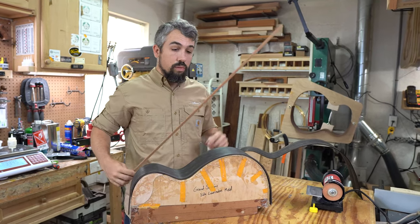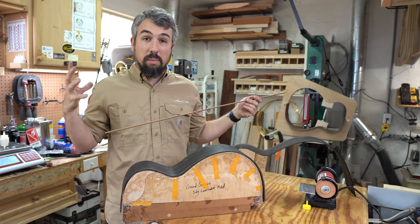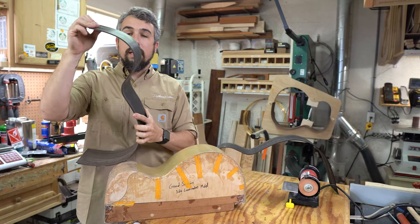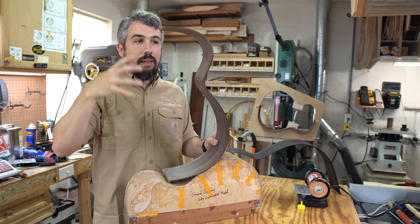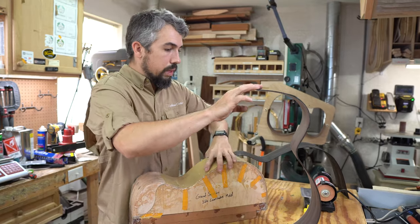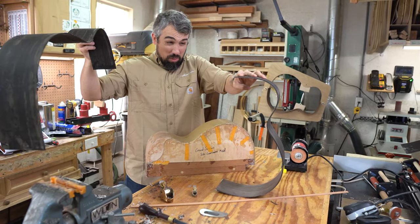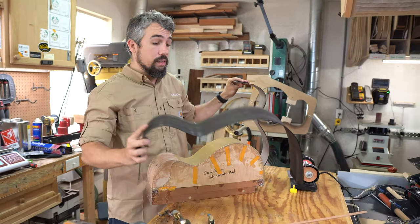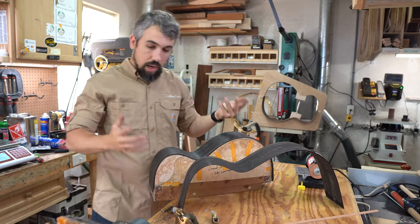In a future video I'm also going to use solid mahogany for my kerfing instead of standard slotted kerfing, which will make the sides that much stronger. The third benefit of laminate sides is torsional rigidity — the bending resistance here is almost impossible compared to a single-thickness side. When you have a neck block strengthening the upper box area of the guitar, I think it's going to really help with avoiding neck resets in the future because everything is just that much more stable.